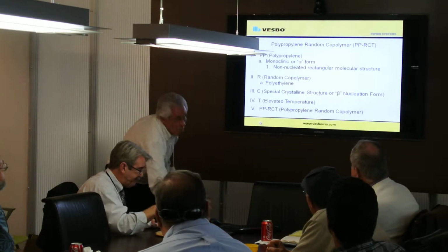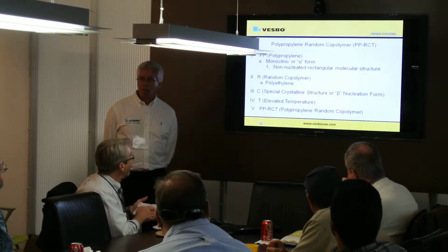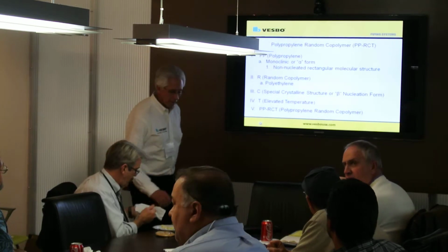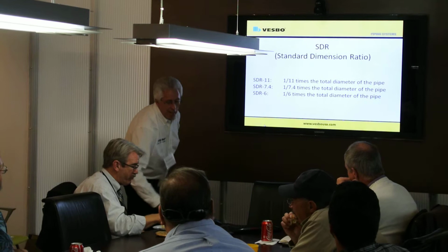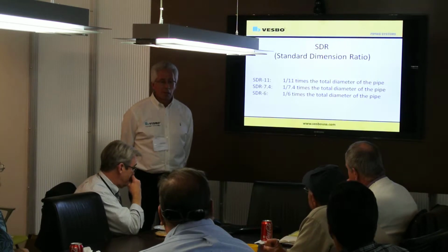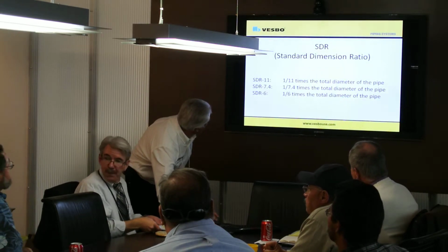Another thing you probably are not familiar with is the term PPRCT. It's still polypropylene random copolymer. C is for crystalline, T is for temperature and pressure enhanced. In short, it handles higher temperatures and pressures. SDR, instead of using Schedule 40, Schedule 80, and so on, it's typical piping that's just SDR. And then obviously the different types.